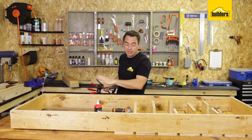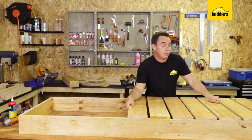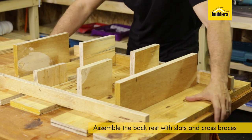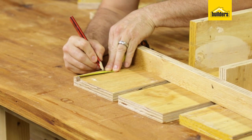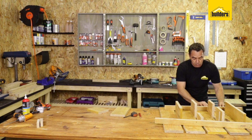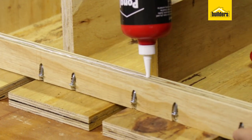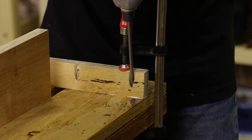What I'm going to do next is the actual backrest — that's not going to be attached to the base; we're going to join it with bolts later on. We're doing the backrest using the same size spacers. I've got two cross braces here which are 770mm long, and we're going to put those 75mm in from the sides. Exact same principle — lining everything up so it's flush and square with the edge of my workbench, marking it so I know exactly where to put the pocket holes. In go our Kreg screws, glue on the mating surfaces, clamp it into position, make sure the spacing is correct, and there's our backrest frame.